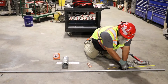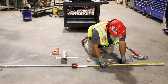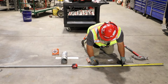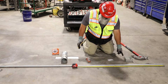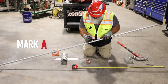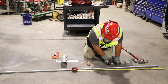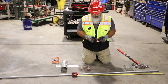That pipe shrinkage is three-quarters of an inch. So we take our pipe and tape measure, lay it out, find 40 inches, and add three-quarters of an inch — putting our mark right at 40 and three-quarters. We only have 40 inches from center of that to the beginning of our pipe, but we add the shrinkage. We run that all the way around with a pencil — not a Sharpie, a pencil. That's our mark A, the establishment mark. We go back to our card, which tells us where to place our other two marks because this is going to be three different bends — hence a three-point saddle.